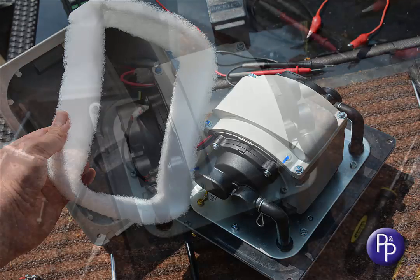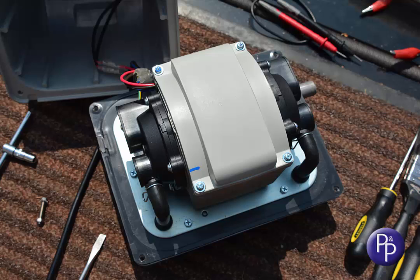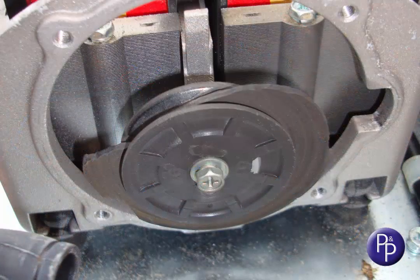This isn't a filter, it just helps keep the pump quiet. We now have the internal core visible. If your pump has stopped and the service light, or your external beacon is lit, chances are you'll have a split diaphragm. The quickest way to check this is to pop the lid of the internal core off.